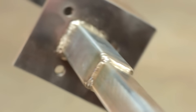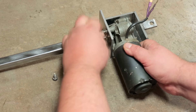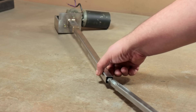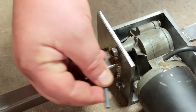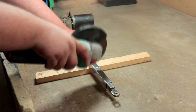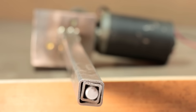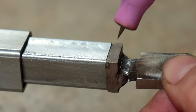Drive speed is not high, and it's easy to calculate. The thread pitch of the stud is 1mm. If the engine speed is 30 RPM, the movement of the drive rod for retraction or extension is 3cm per minute. This linear actuator is part of a future project, and if I succeed, you will definitely see it. I made a mistake with the length I needed and decided to shorten it. Now you can see the cutaway of the device.